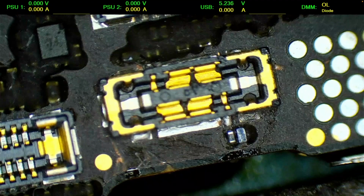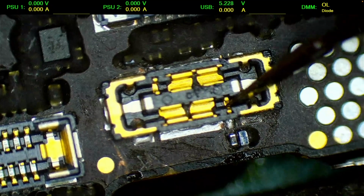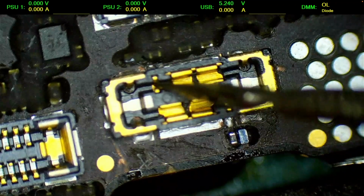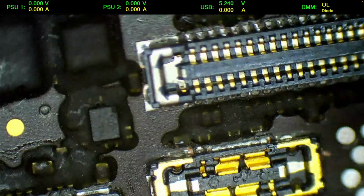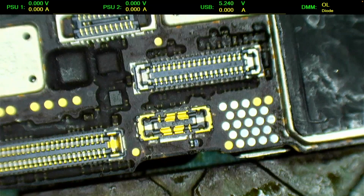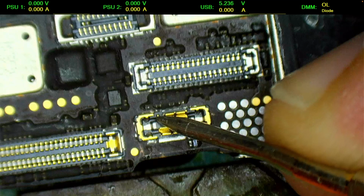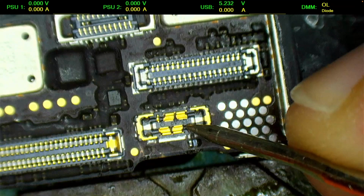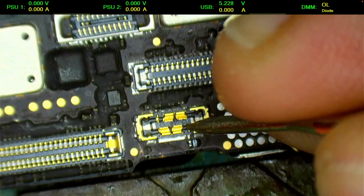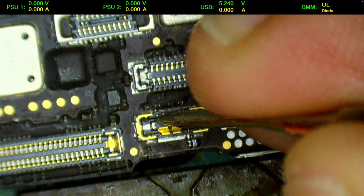Yeah, the connector seems to be soldered properly. You force the pins like this. Yeah, that's soldered on. Okay, let's do also a multimeter test. So again, we should have like 0.4 something on both the data lines, data and clock line. Okay, 0.42, and here 0.43, right? Good.